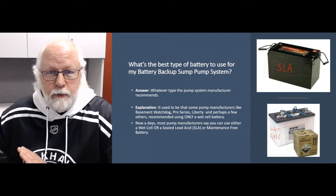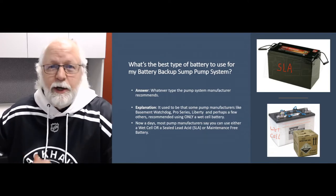First of all, let's start off with something right off the bat. I get this question every day. You can't take any kind of battery — whether it's a sealed lead acid battery, a wet cell, a deep cycle, or a car battery — and just connect it to your main pump that's in your pit right now to make that a quote-unquote battery backup. Doesn't work. If you can find a way to do it, you might get that pump to run for maybe five, ten, or fifteen minutes at the most, if you're lucky. Those batteries don't have the power to drive an AC-powered pump — the amperage and power required just isn't going to happen with a battery.